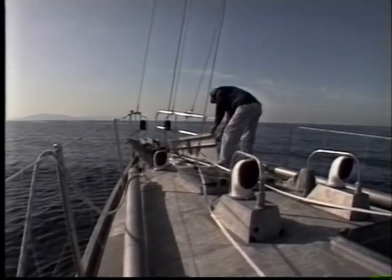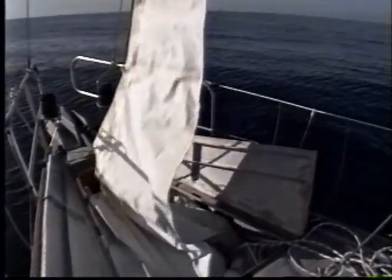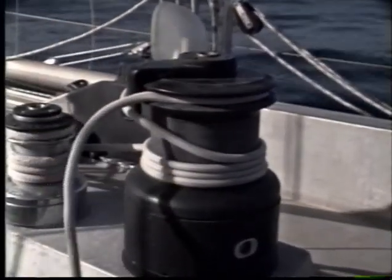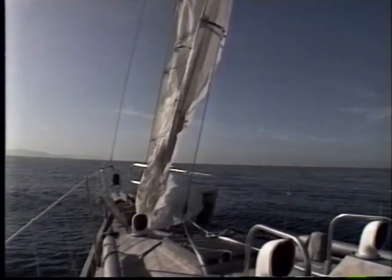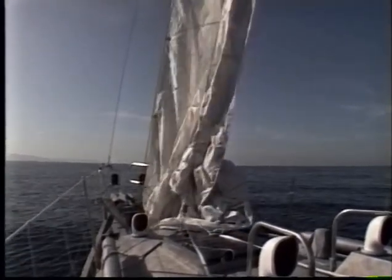Our working jib is attached to the headstay with old-fashioned piston hanks. They make changing a headsail when it's blowing hard something we can deal with. The sail is stowed in the self-draining foredeck well. Hoisting and putting it away later are very quick, and we don't have to worry about the extra weight and windage aloft of a roll of furled sail.